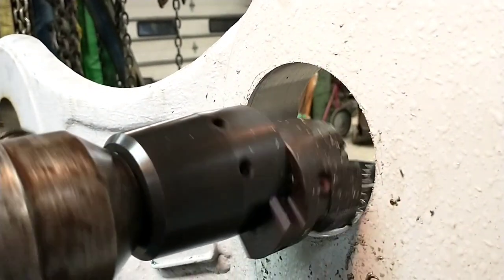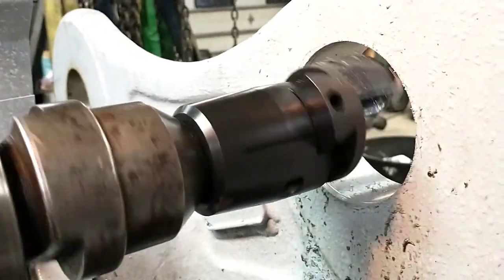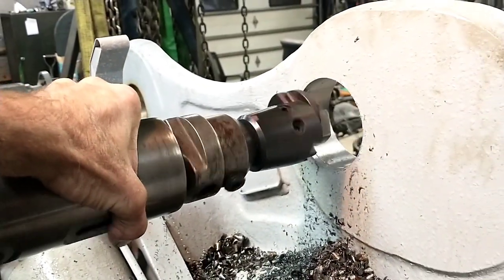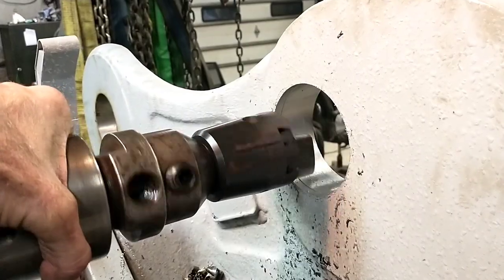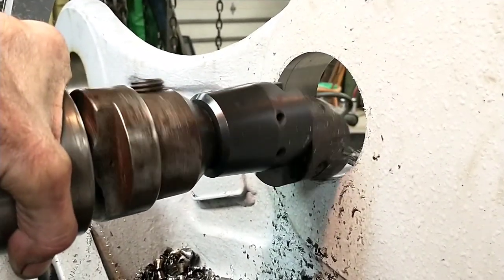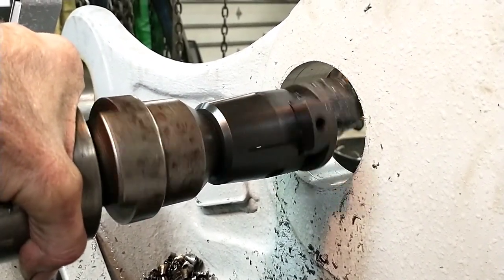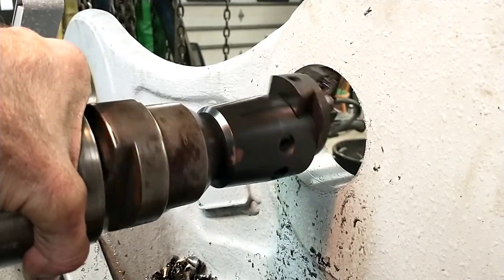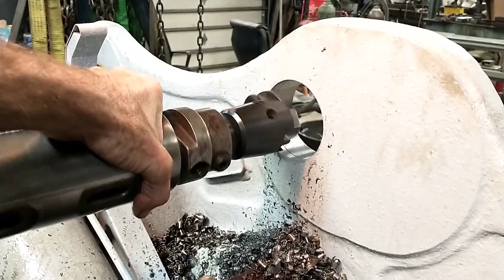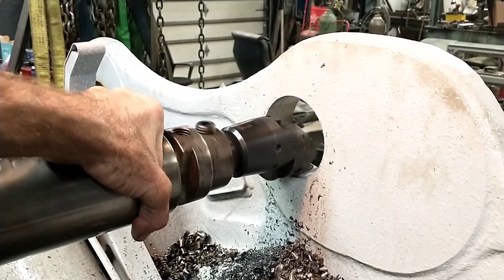So far so good. Seeing just a little bit of evidence of hum in there. Try seeing if I ride up and if I can deaden it out of there. Once it gets started, it likes to follow the previous track and go to singing. A lot of times, just a little bit of extra pressure on the bar is all it takes to make them stop.